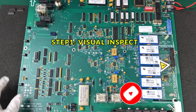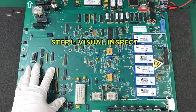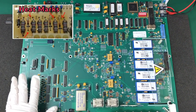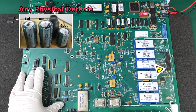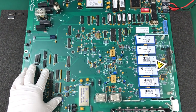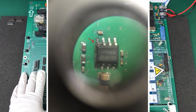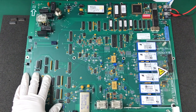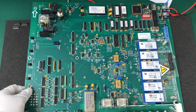The first step, as most people do, is to perform a visual inspection. You must focus on searching for burn marks, heat marks, blown components, or any physical abnormalities like bulging capacitors. One good example is when I troubleshot a motherboard and found an IC using a microscope with a broken pin, probably due to electrical overstress — the broken pin was hardly detectable with the naked eye.